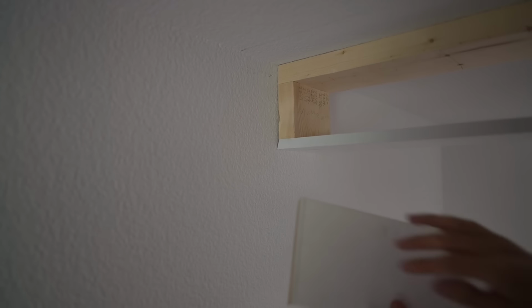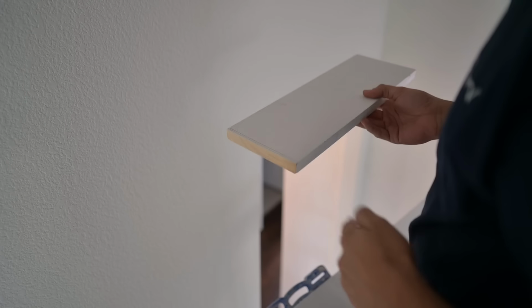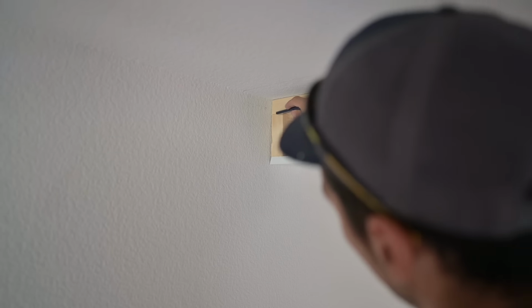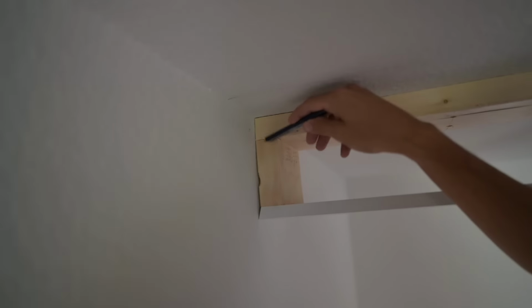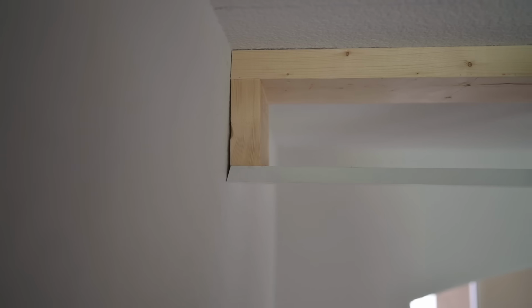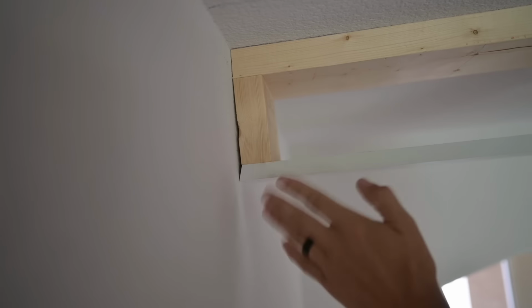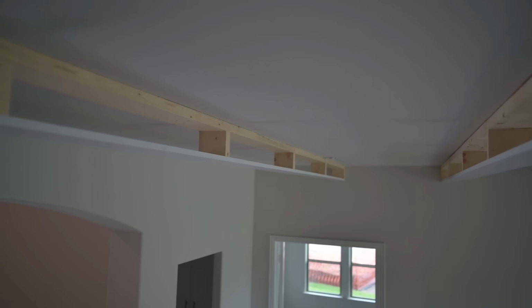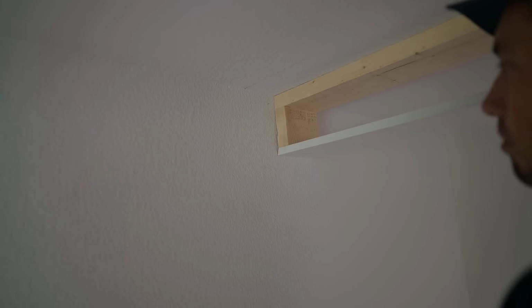But ultimately what you're doing with this, you're gonna take this to your miter saw and put it up against the fence and then dial in to that angle there. And that's essentially what we're gonna have to do with all of these. You can even see this board right here is screwed just 90 degrees to that, and you can see how there's a big wide open gap down here. So right off the bat, you know it's not flush up against that wall. So what we're gonna do now, we're gonna find out all these angles. Usually it's 1 or 2 degrees off, and then we gotta find the other side all the way on the other end. And really, that's essentially it for wrapping these beams with the sideboards.